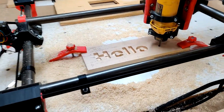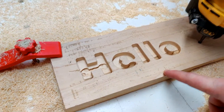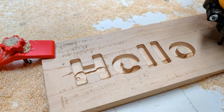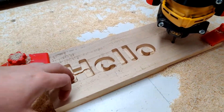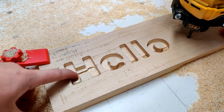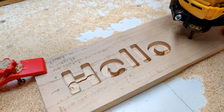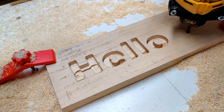I've got the board mount down below, and the maple cut out here — a sheet of 1-inch thick maple. At first I just wanted to see what I could do, so I tried half-inch deep at 30 inches a minute with 2D adaptive. That's the deep pocket you see here. It didn't do the greatest, but I just wanted to throw a heavy load at it and see what it would do.